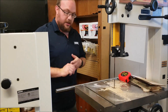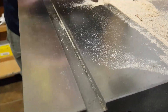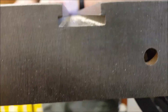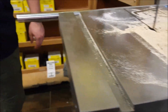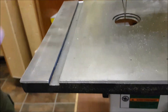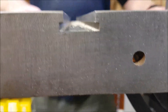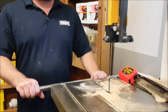The last thing I want to talk about with miter tracks is this: if you look at the bottom of this miter track it's got a T-slot in it. That's designed to put feather boards or feather wheels in. The smaller Rikon over here does not have a T-slot, so it's a little bit more limited by what you can put in there. If possible, get something with a T-slot — it just makes it more versatile.